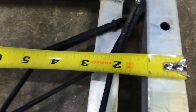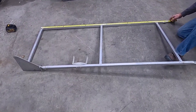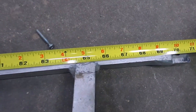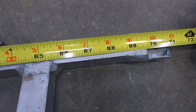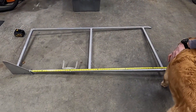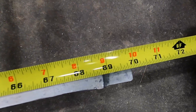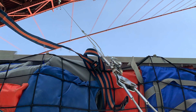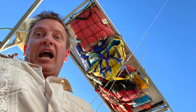The entire rack is made out of one inch square aluminum tube. Here's a couple shots showing the height of the rear frame. If you try to do this yourself, I would think the best way would be to set your boat up and then hang your panel about where you think it should be on the boat and make your measurements from there, rather than trying to do all the work in the shop and just hope it comes out right. Remember when determining the height of the solar panel you can't go too low — if you go too low you're going to hit your rear stay, so make sure you have that measurement before you do any cutting.